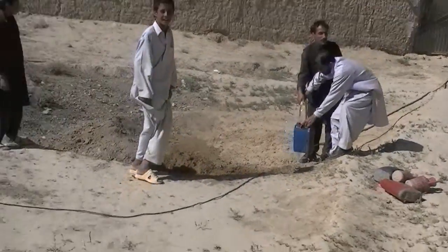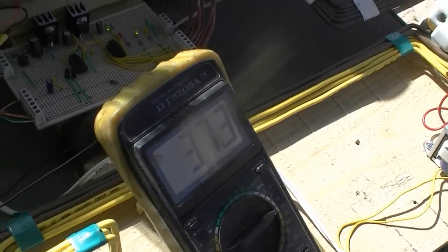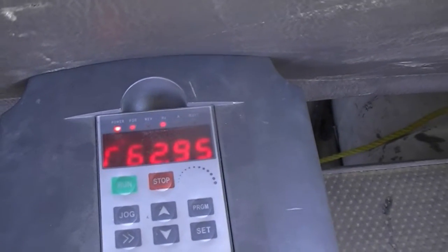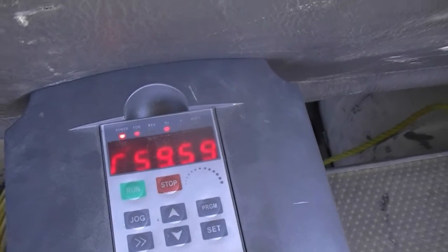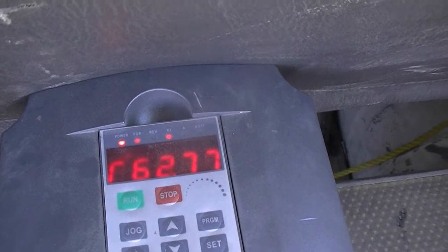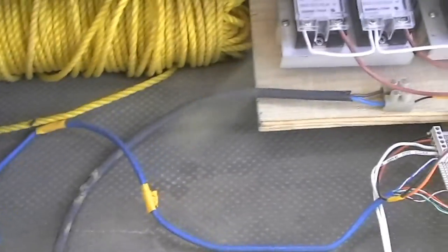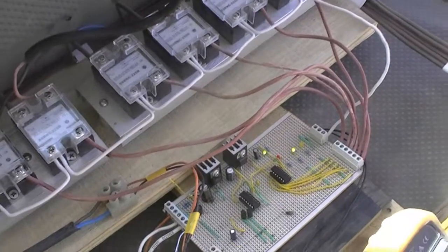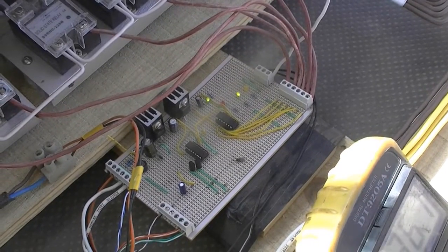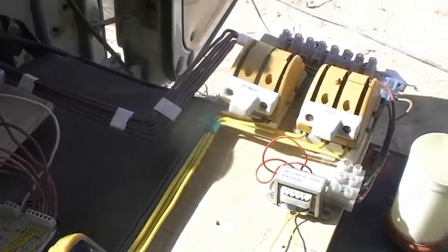At the moment we're maxing out — we don't want the voltage to really go above 380 volts DC — and right now at about 62 to 63 hertz the frequency is going down. The circuit controls based on the voltage: we want the voltage to stay high, so based on the voltage the signal for the frequency goes up slowly and down quickly, to take the load off so that the voltage can stay high.